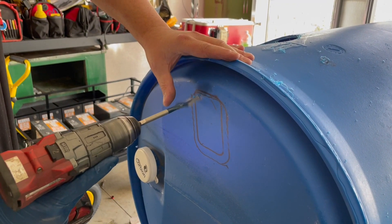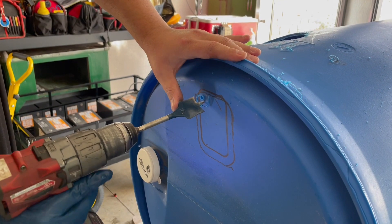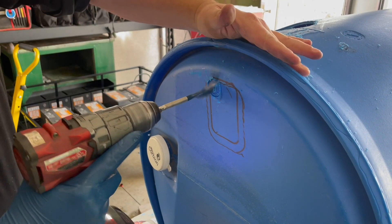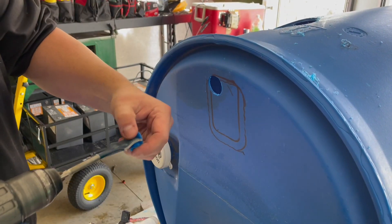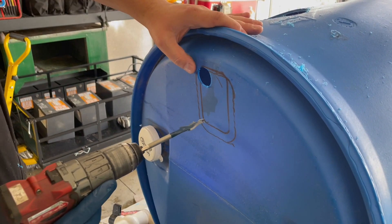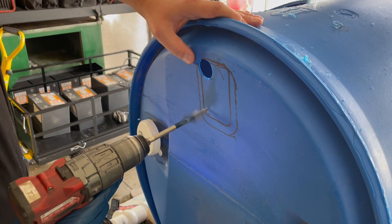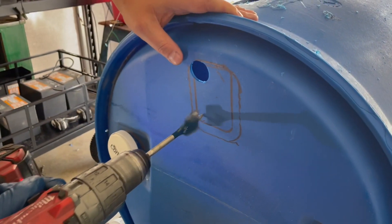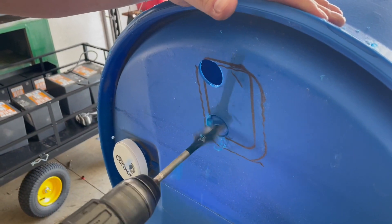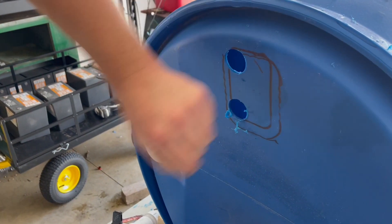I'd considered putting this sideways because it reaches down into the barrel pretty far — I probably could have gotten a few more gallons out of the storage — but I liked this configuration a lot better. Hot tip: if you're trying to cut a rounded-corner square or rectangular box like this, a great way to get that nice clean circular corner is to use a spade bit or hole saw first, then cut straight lines later. I'm lining this up, and it doesn't have to be perfect. I've got that orange piece of rubber I was showing — I'm going to make a custom gasket from it and put one fitting on the inside of the barrel.